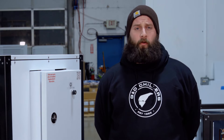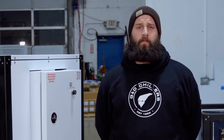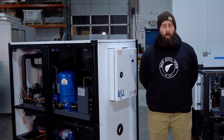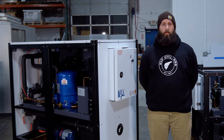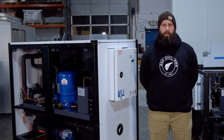It's important to know that if you're reading with a refractometer, 35% glycol has a BRIX value of 26.5 BRIX, or a plus two degrees Fahrenheit freezing point. It's very important that you use propylene glycol with inhibitors. The glycol we offer here at G&D is 97% pure, with that 3% being inhibitors to prevent organic growth, rust, and corrosion.